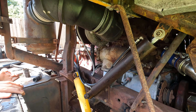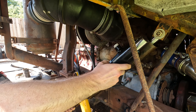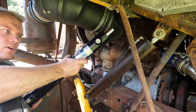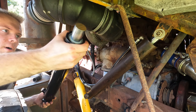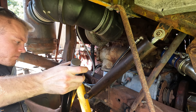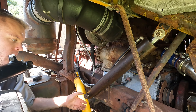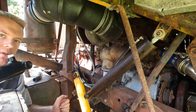What I came up with is this guy. It's called an HMW 2016 from Hercules Sealing Products. It's an inch and a quarter rod as compared to my inch rod on the stock Power Packer, and the body is two to two and a half inch. It's going to work for my application — it's just a little bit bigger than what's here already. The base mount is a cross tube design — a tube simply welded to the body of the cylinder, whereas the original Power Packer has a turned piece of metal welded to the base giving you an offset from the bottom of the cylinder to the pin.